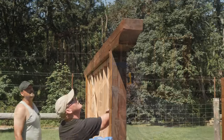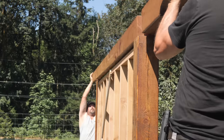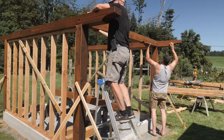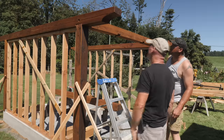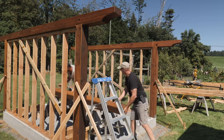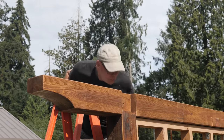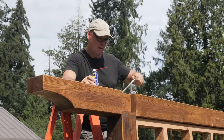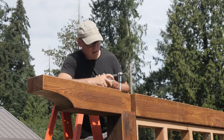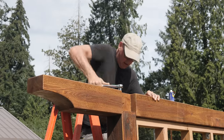Calvin came back to help me install the finished beams over these stud walls. I needed to trim the length a bit, so we pulled it down again — I had left the laps a bit long when I cut these ties, just in case. With a long bit, I'll drill down into the posts and run in the galvanized lag bolts. Some penetrating oil helped here. There's a fair amount of redundancy in this connection: there's the long lag bolt, plus GRK structural screws securing the wall sections to the posts and beams. Later I'll add some corner braces between the beam and each corner post.